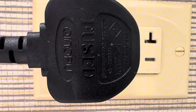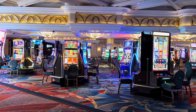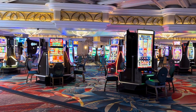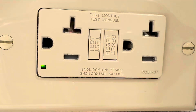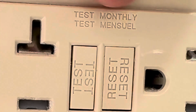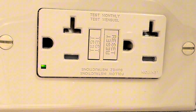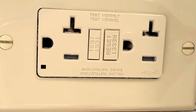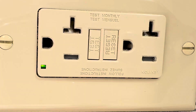What's also incredibly interesting is that for selectivity, this hotel won't want us plugging things in and tripping an RCD somewhere further down the circuit. So they've actually built the RCDs into each of the outlets. By pressing the test button — which suggests you should press it every month, and I'm sure that happens here in the United States — you can see it trip off and the green LED disappears. When you reset it, you can see it flick to red and then back to green as it comes back on.